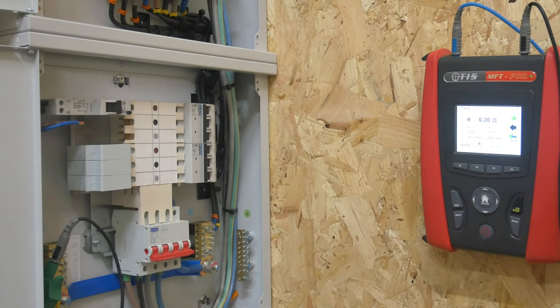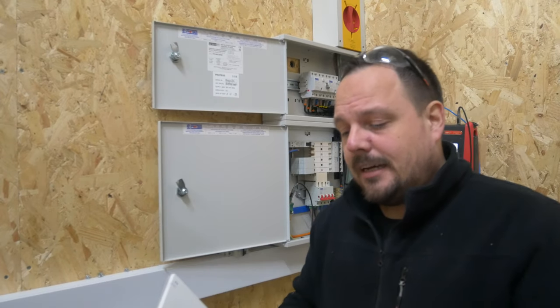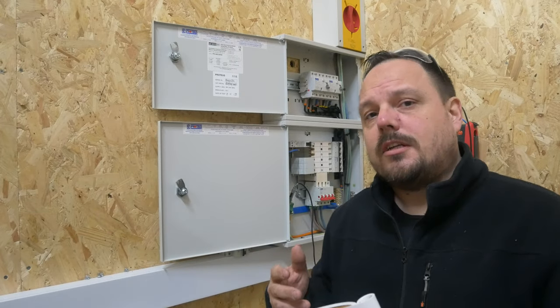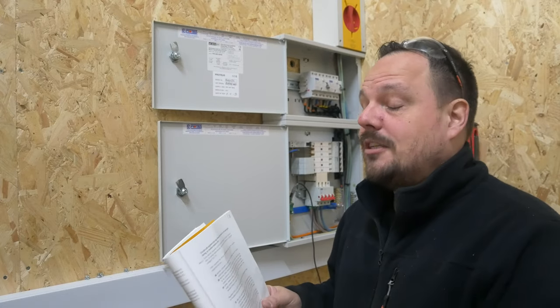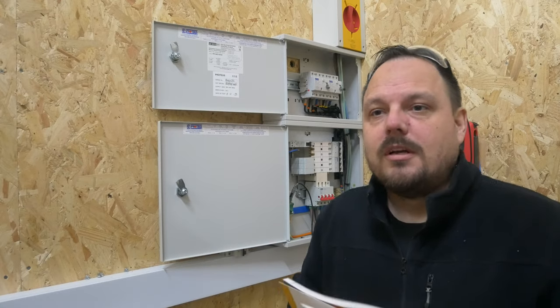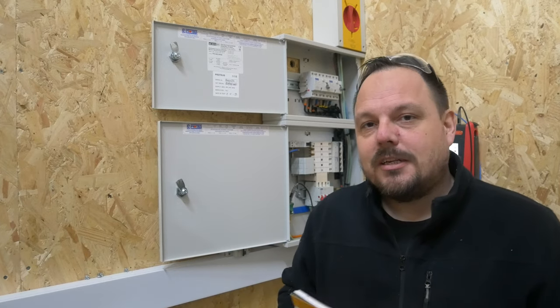This one's a little bit different for your three-phase systems, so I'm going to have a look at Guidance Note 3 before we dive into it. When we're talking about insulation resistance testing on a simple install, you can do it at the origin and check the whole system as a whole. But with this, because it is subdivided with distribution circuits, you can break it down into smaller parts — that's really to try and stop the culmination of lots of circuits and distribution boards dragging your overall value of insulation resistance down. That wouldn't be a factor here but it could be out in a real installation.